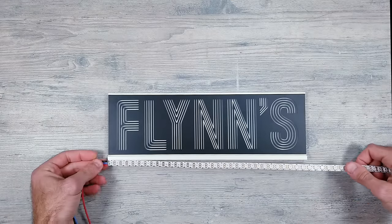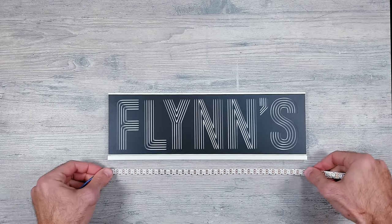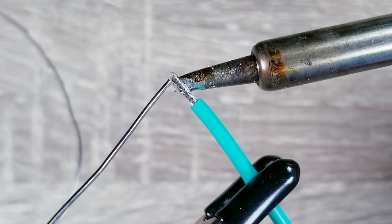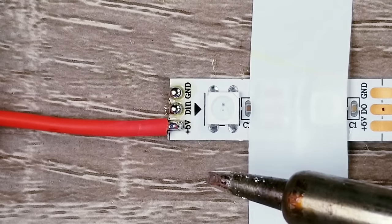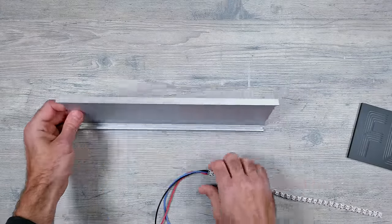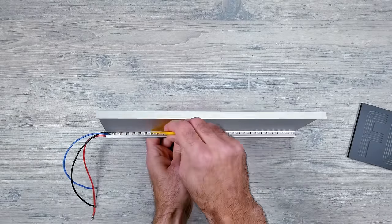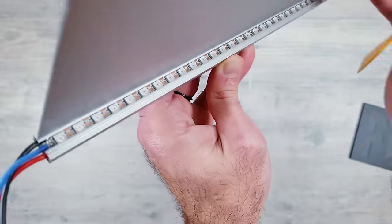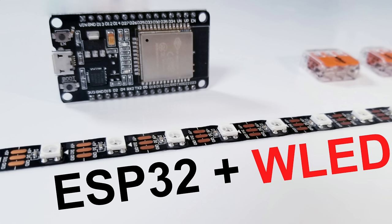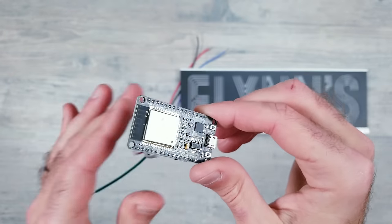To get these lit up I'll be using some WS2812B strips with 100 LEDs per meter, and I've already attached my own 18-gauge silicone wires to the beginning. I won't go over that process since I already made a soldering tutorial video covering that in great detail. What I'm doing here is cutting off the extra pixels I don't need. What works best on these short pieces is to take the sticky tape off the back and slide them into the channel, then use something that fits inside the groove to gently press them down to secure them to the bottom of the aluminum. To control the lights I'll be using WLED installed on an ESP32 board — I also made a walkthrough tutorial for that process if you're interested.